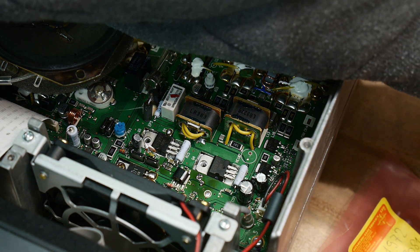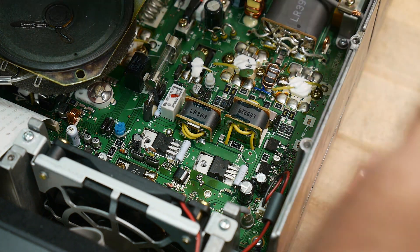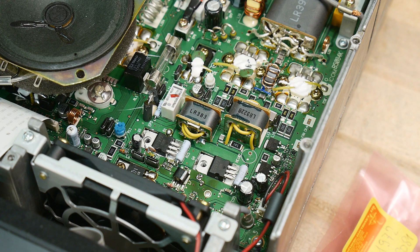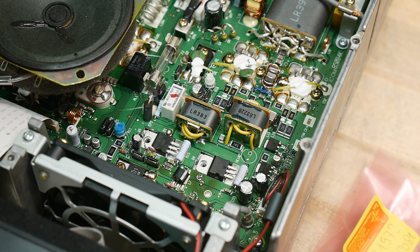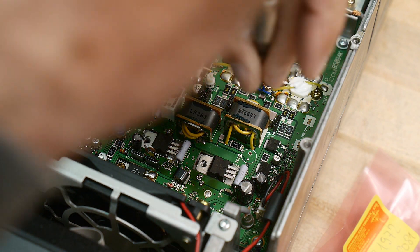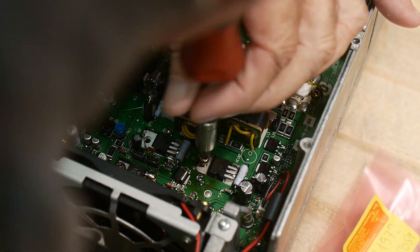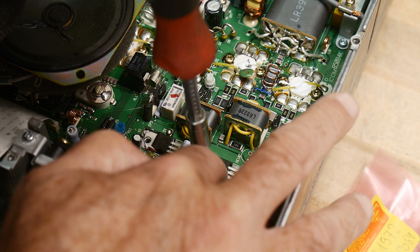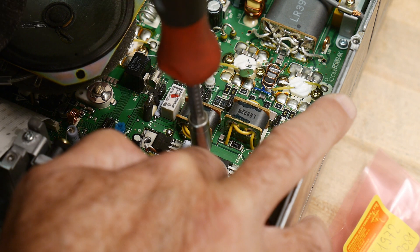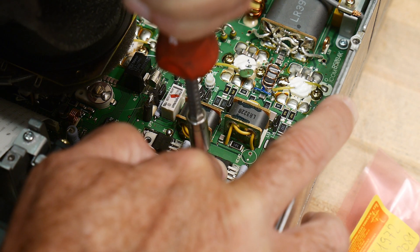I'm going to put away the heat sink stuff and put a lid on it. You would not believe how many accidents I've had with heat sink compound — just horror stories. Now if we can put the screws back in — the screwdriver is a bit magnetic so I can lower them into place. I want to tighten these down first before I solder, because I don't want my solder to crack. As I tighten it, I'm applying opposite direction pressure on the transistor so it doesn't move.